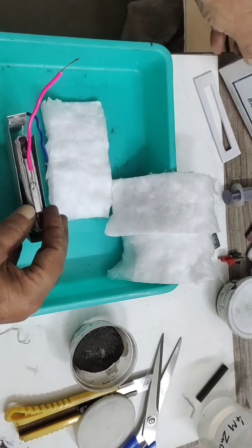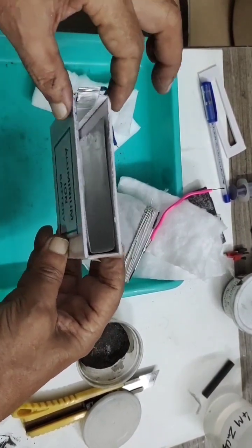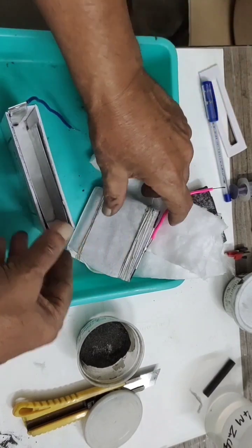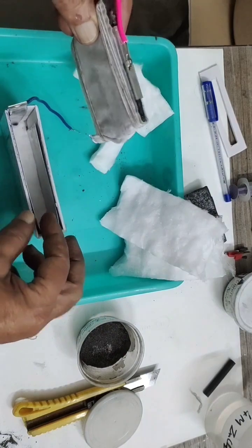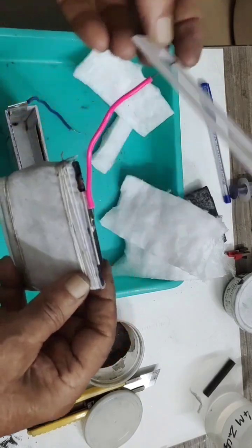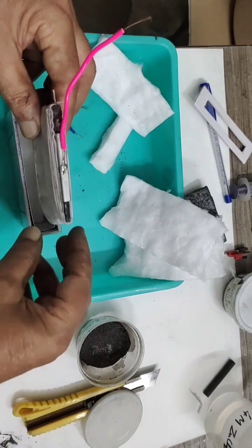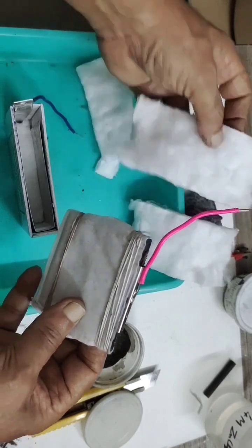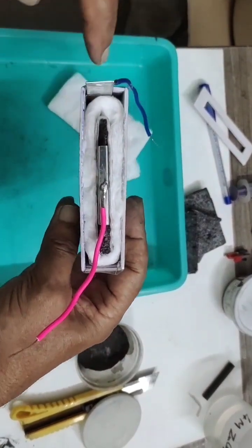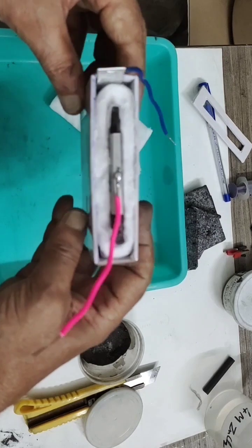After placing in the container, you can see the steps: I inserted the aluminum negative plate, then in the center I cut the ceramic pad to size and inserted it so it sits slightly higher than the aluminum plate, projecting out at the top. It must not make contact with the negative plate. Then I shield the positive electrode with the same ceramic pad surrounding it. This is how it looks — negative aluminum plate on the outside, positive electrode in the center.